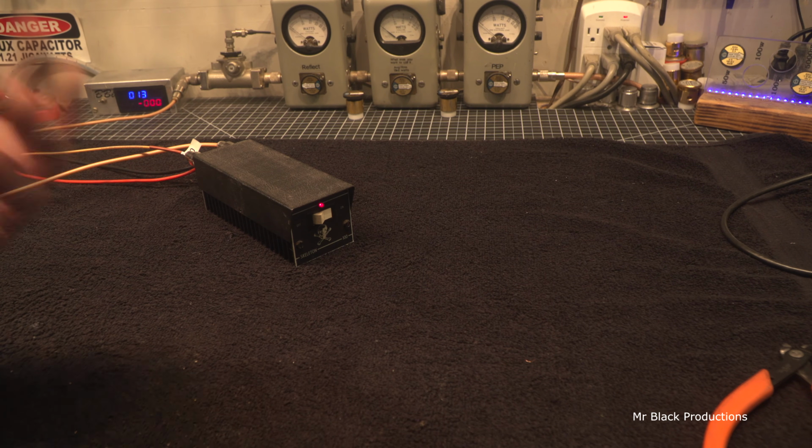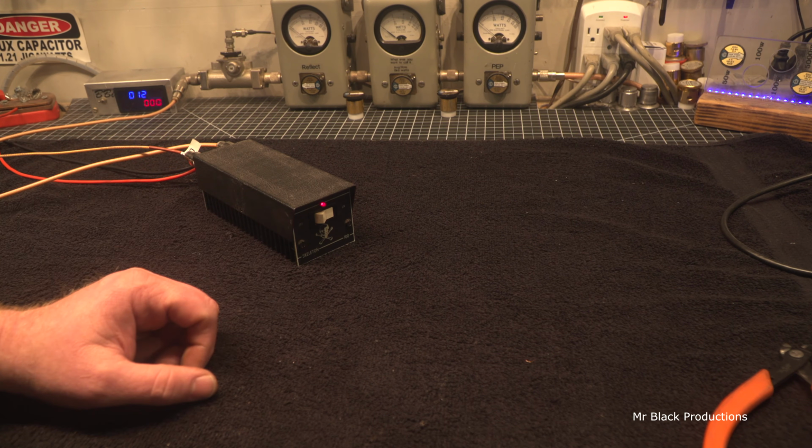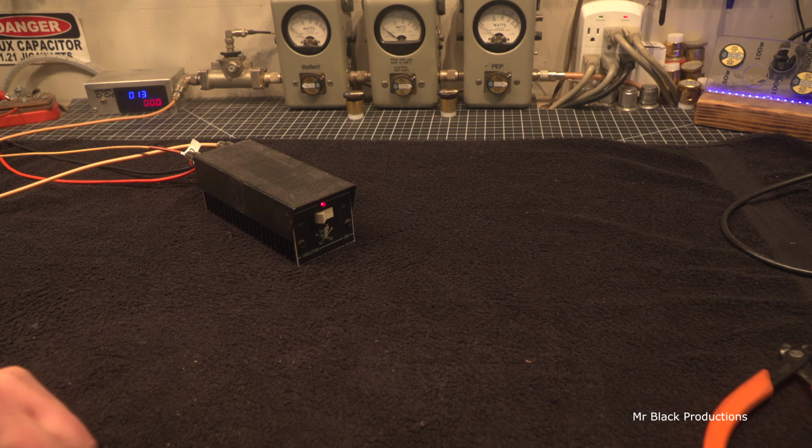I mean, we're talking like a $200 amplifier, and we're talking about a Texas Star modulator, a V Plus modulator. Like a $200 amp that everything in it is burned because everything was on and it got hooked up backwards. It's the only thing I can think of. Why else would the protection diode be blown out of it?